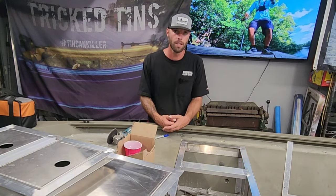I'm going to build a pan that's basically going to fit in here from left to right and vertical height that I want. I'm going to turn like a 1-inch lip on it so I can shoot rivets into this front deck, rivets into the floor, and then I'll shoot some rivets in here. But I'm going to shoot these from the face through here, that way the back of the rivets isn't sticking out here because this is going to be turf. Very simple. And something like that is going to be cheap.